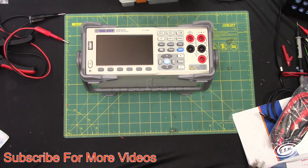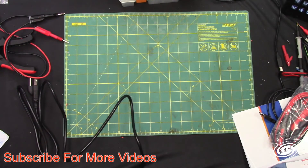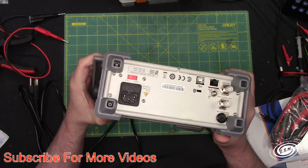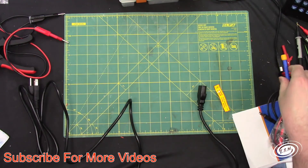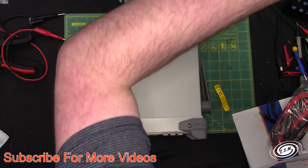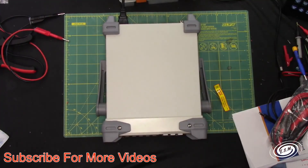I see a power port I can plug this into, and I'll route the cable correctly at another time. I'm going to plug this in here. It is set to 220 — I need to set it to 110. There's a little switch back here; right down there it's set to 220, I need to set it to 110. That's a good thing; I don't believe I need to change any fuses. It is weird how it comes with a 110 plug but was set for 220 — that is an interesting concept.